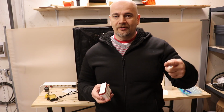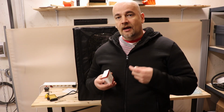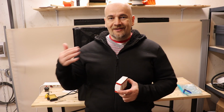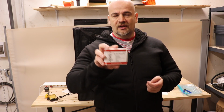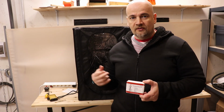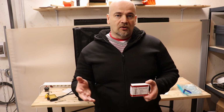The conclusions. Well, to be honest, when I recorded that video with the firmware, I wasn't sure that I would succeed. I'm not sure if I did everything correctly, so I raised only by 10 degrees Celsius. I know that this whole metal hot end can handle higher temperatures, but I'm not sure that the heating cartridge and thermistor from the stock Ender 3 V2 can handle it. So it works, but if I did something wrong, please write to me in the comments.